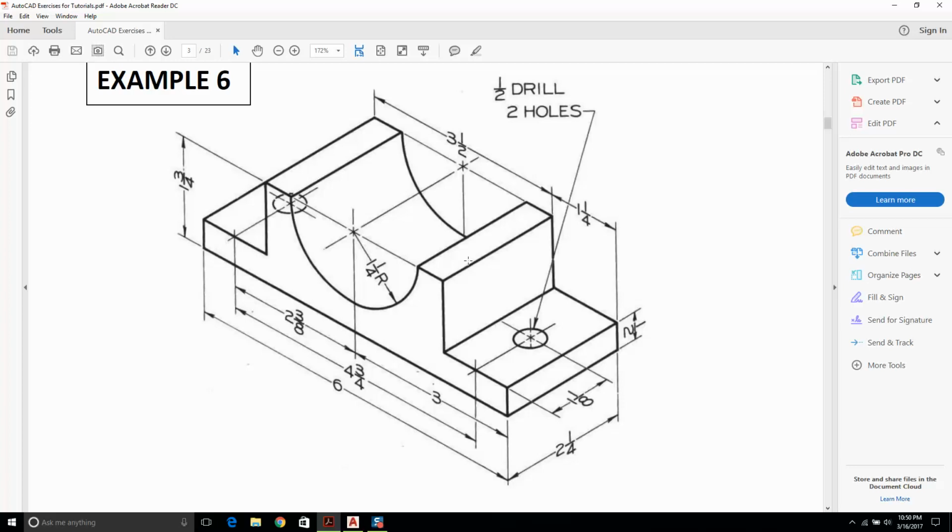I've been here so long now, I can't remember how we used to do it. In Europe and elsewhere, they call it first angle projection, and everything is back to front. So just be aware that there's two different styles. If you're sending drawings that are done in America to Europe, you might get your parts back to front. That happened to me once before, but I don't want to get bogged down.